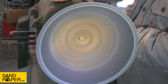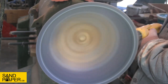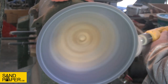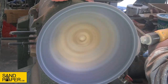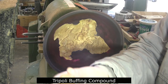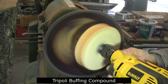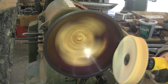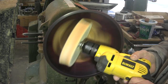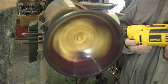On the back side of the bowl, if you look at the way I've got the drill tucked into my body, that takes the strain off your elbows and wrists and certainly off your arms. I like to tuck that drill into my body and then just kind of sway across the surface of the bowl. Buffing time - we sanded from 60 to 800 and now I'm using Triple E buffing compound just to buff out the resin before the first coat of finish goes on the bowl.